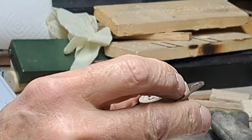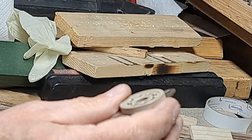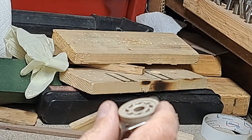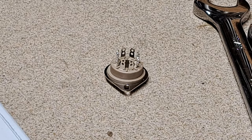And I'm going to tell you something right now — don't think that that's a compromise. That thing is as good as an old cinch or anything like that. Unless you're the type of guy that has to have a ceramic socket. I don't like ceramic sockets — I've never used them and I've never had good luck with them. I like the phenolic material better, like this. This is a really good socket and tubes fit in it so nicely. It's the new Belton — EK something, I forget the number. But if you're worth your salt in amp building, you'd know that that's a good one.